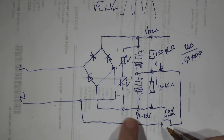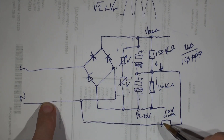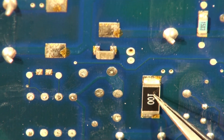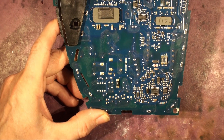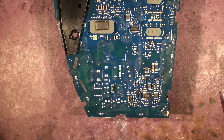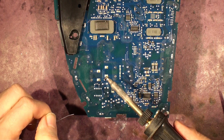So all we have to do to convert this — strictly speaking, with a few other complications we'll get into — is to remove this link. Then this will work from 220 volts instead of 110. There's the link in question — this little thing in the middle of the picture, next to this 10-ohm resistor. Get yourself a soldering iron and remove it. And there she is, removed. In theory, that is all that's required.